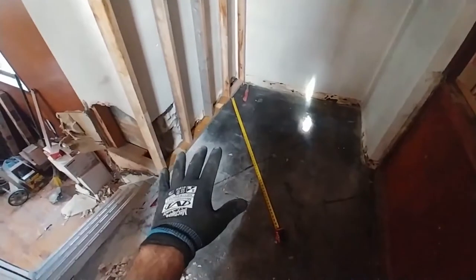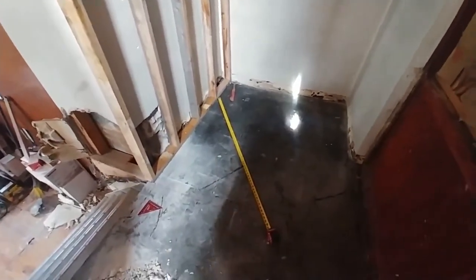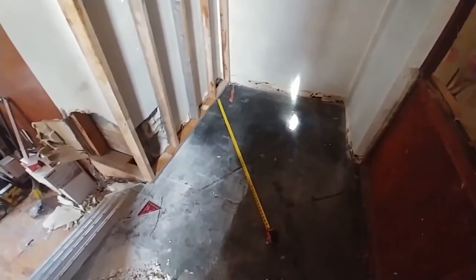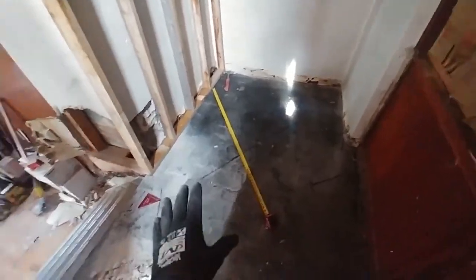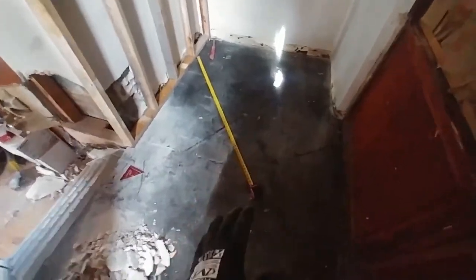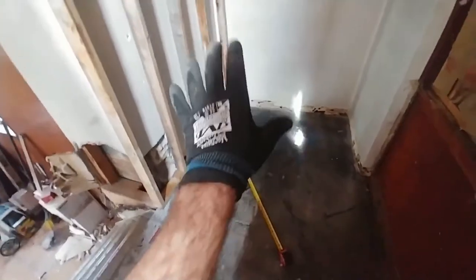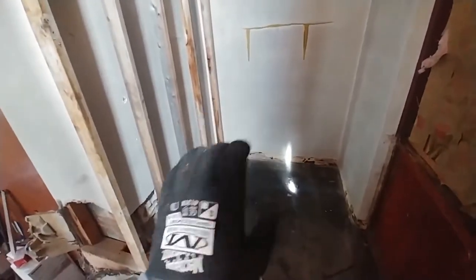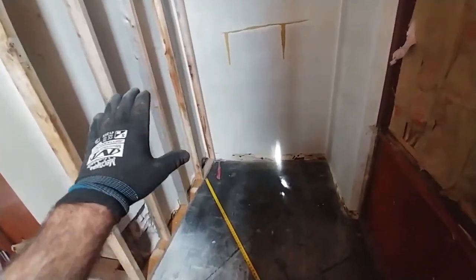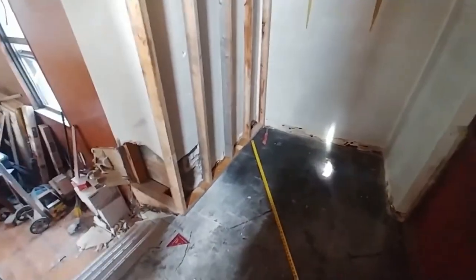We've got a flat, relatively level floor here. We may as well lay out a square footprint for the room, for any kind of square format like tiling or anything else like that. There were carpet tiles in here before. When you cover the floor, it can be relatively square when you put it down. And you won't highlight the fact that the room's out of square when you put a square washing machine or countertop or something else in here that betrays the fact that the room's widely out of square.